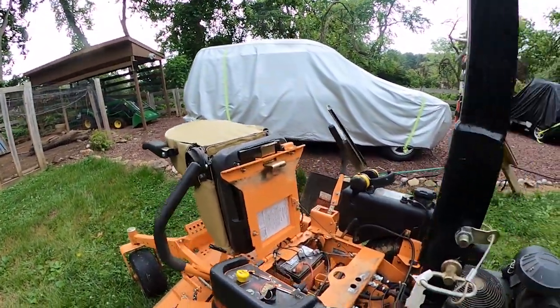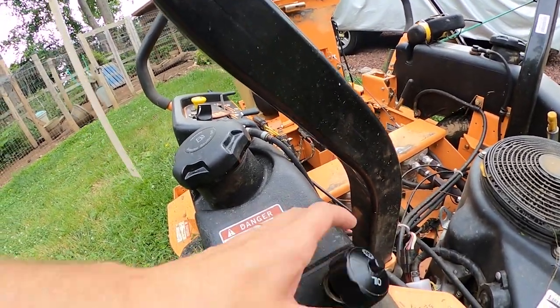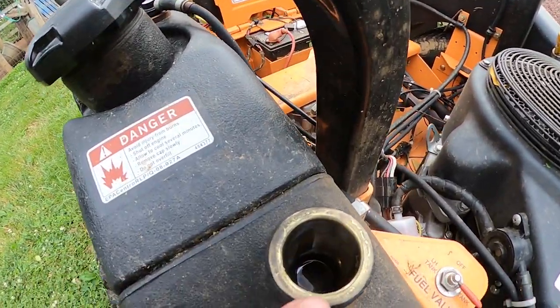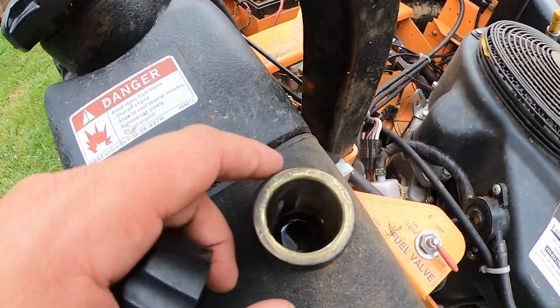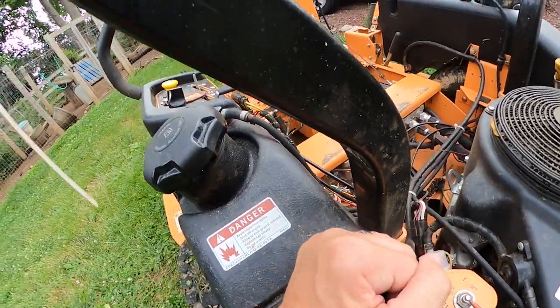So you're gonna wanna obviously keep your hydraulic oil always topped because, you know, it's hydrostatic. You want it to be roughly about 3 inches below. You can see I have it down in there. I never have an issue with that. I do maintenance on this every year.